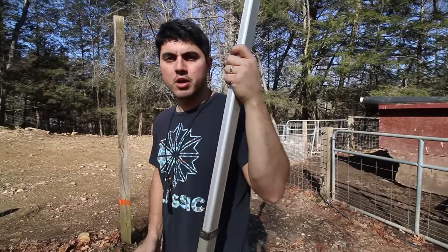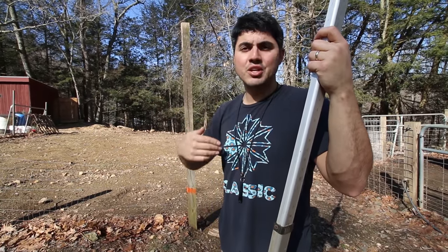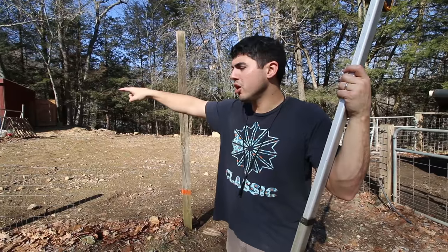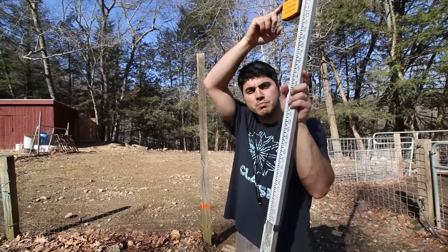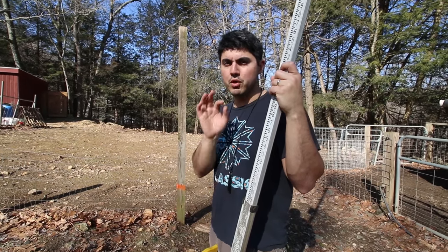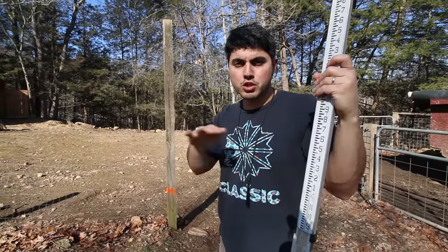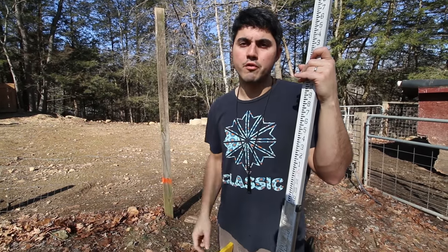That is now our benchmark. That elevation right there is the same as in front of the barn door and it's the same as the road. When I come out two weeks from now and start up, I no longer have to go shoot in front of the barn, shoot the road, and make sure it's all the same — all I have to do is set up the transit, shoot that spot, make sure the target's beeping when it hits that spot, and we can start working. That's a benchmark; the rest of this project will work off of that benchmark. It's not a super accurate one because I just spray painted it — if you want a real accurate benchmark you put a nail in and tap it right in and put your stick on top of it. The thing is, I'm cutting in a road just the first cut, so the first cut can be within five or six inches across the road. Once we lay process on it and get it really smooth, we'll want to work off of a nail, which we'll do in the future.